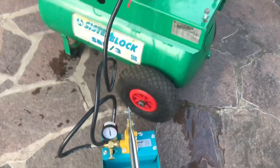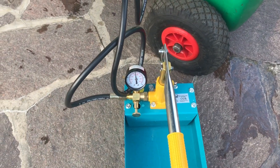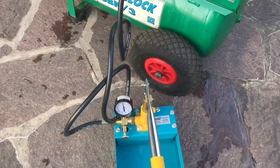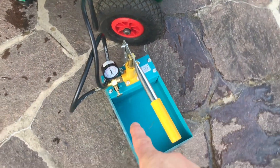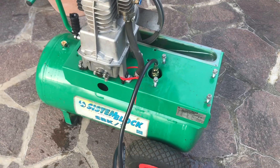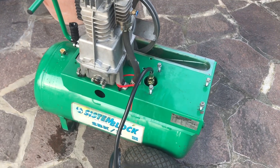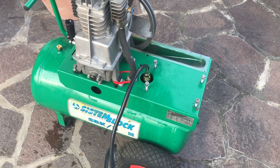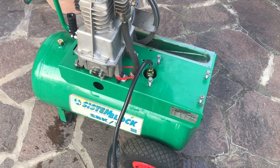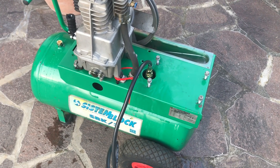So this is looking good at the moment. Really pleased about that. To show how, with a cheap 30-pound hydro test kit, you can test your compressor to really make sure that it's safe. If you've got a compressor that you don't know the history of, you don't know how rusty it is, then this test can prevent you from having a compressor that could potentially blow up.